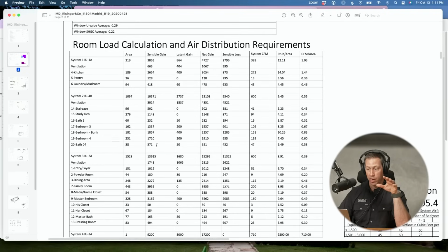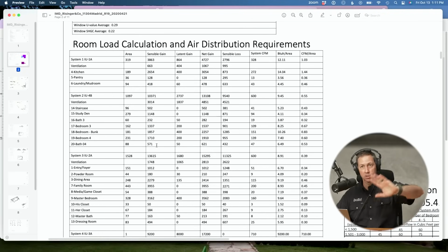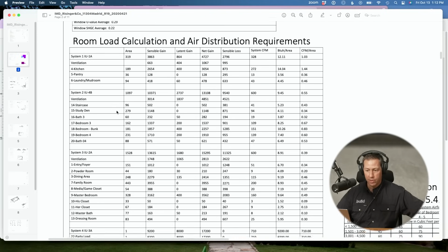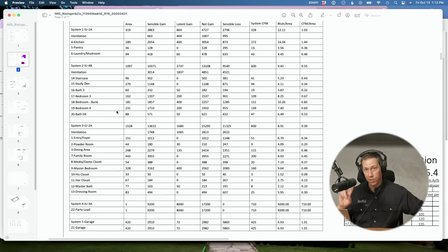That is a terrible load calculation guess, and in fact, my house, you're going to see here in a minute, is somewhere around 1,000 square feet per ton of air conditioning. It's a very tight and a very well insulated house. And so now let's scroll down and look at the actual, this is the part that's called the manual J. And again, Kimberly and I went into this. I'll link below so you can see that video, but you saw the title of it if you want to go see it. First off, my house actually has 5 systems or 5 zones.